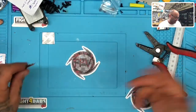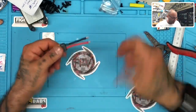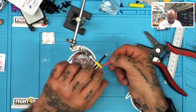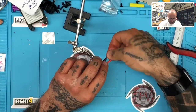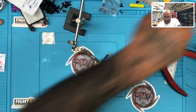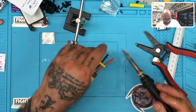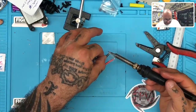But on these, I will tell you flat out that if you were to flatten them, to be very honest with you, I have had just as much success with that. As a matter of fact, soldering wise, it's even better. So sometimes I see people crank them and twist them so tight that to try to heat it and get the whole thing through to the board is almost impossible. Twist them a little bit, put them together, but on these your pads are big enough to where if you just give it a light twist but then press it to where they're more flat, you can cover more surface area on the board that way, and you get a little bit stronger of a bond there with the solder. So just a little bit to try and help if you find that you're trying to put on your XT60 cables and you're having the hardest time getting it to stick to the pads or getting the solder to melt all the way through.